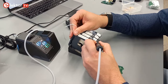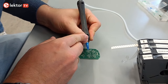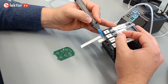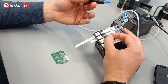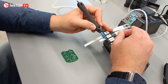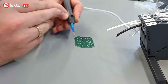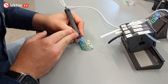Starting the assembly demo with a 100 nF component, then moving on to the LEDs — there are quite a few. The LED orientation is added to the silkscreen to make hand pick-and-place easier. The orientation is visible from the tape, so you rotate the board as components come out, and all 12 LEDs come in the same direction. If a component needs reorientation, you put it on the desk, rotate it, and pick it back up. One nozzle supports a variety of components without needing to swap.